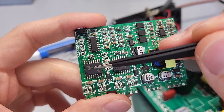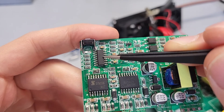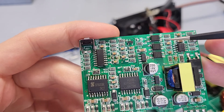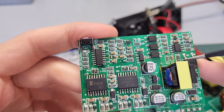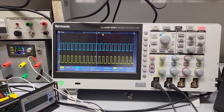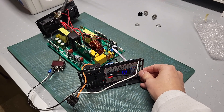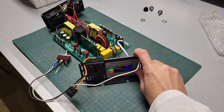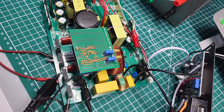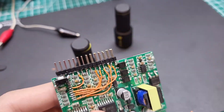Both gate drivers on the tiny board are completely shorted — but not just that, the power supply for the IC is also shorted, and they clearly removed the markings to prevent repairs or replacements. There are also two optocouplers going outwards, so there's still some chance. At this point, after hours of work, you'd normally expect the problem solved — in 90% of cases that's exactly what would happen — but clearly luck is not on my side. From now on we are going full hacking mode.